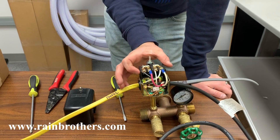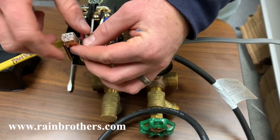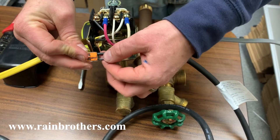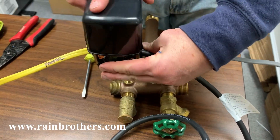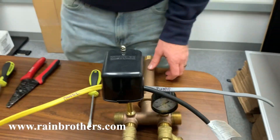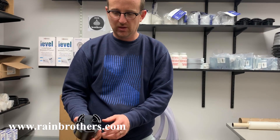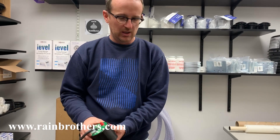So this is what the end product will look like when it's wired in. You'll tuck this in, maybe even put some electrical tape around that just to make sure it doesn't short out. You want to make sure that there's no bare wire exposed — it should be all encased in this connector. We'll replace the cap for the pressure switch, and then set this WaterPro on the floor, ideally close to your pressure tank or under your plumbing where it can detect water. As soon as these sensors on the bottom get wet, it's going to open the contact for your power supply going to the pump, which will cut the power off and prevent your house from flooding.